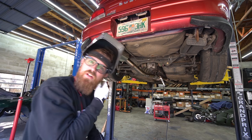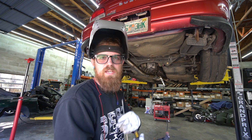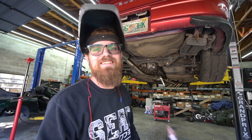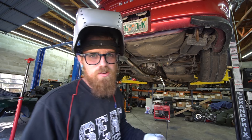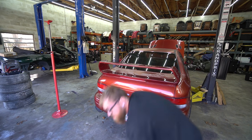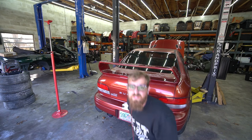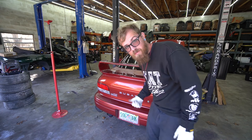She's officially hanging on her own. One thing I do want to do — it is low. I plan to redo this section, but I couldn't really get it to tuck up any higher because I don't have the pieces to redo starting from that flex joint. I'm going to lower it down and just make sure it's not touching the ground. If it's not, then we're good to go — we'll pull it off and weld it out. That's not bad at all. We've got a solid three inches of clearance with the car at static drive height. That should honestly be fine. If it's a problem, we'll fix it. So let's pull it off and weld it out.